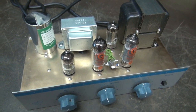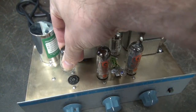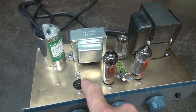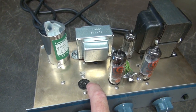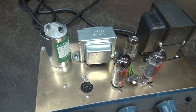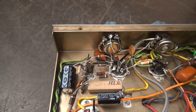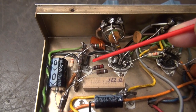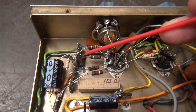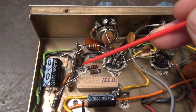Time to modify the Precision S10 into a guitar amp. Let's make this thing usable. This tube, the 6EU7, is going away. That will be replaced with a 6AV6 inverter tube, and here we're going to make another hole for a 12AX7. Let me get things out of the way underneath and we'll get those sockets installed. Our new tube socket is going to sit approximately where this terminal board is, so I need to unwire all this, move it out of the way, and then we'll punch a 3/4 inch hole for the 12AX7 tube.